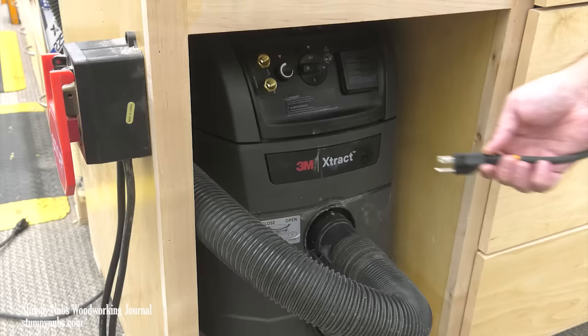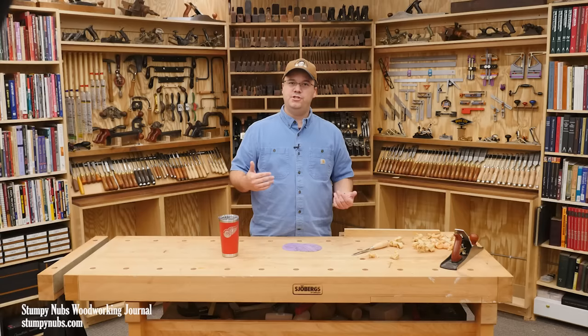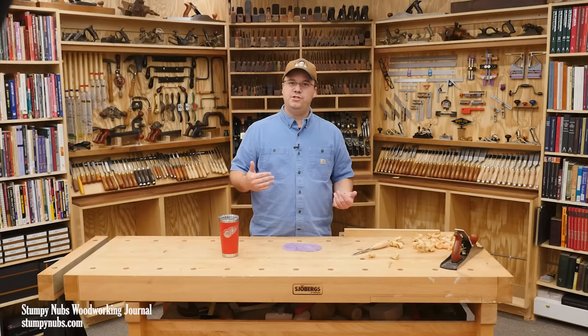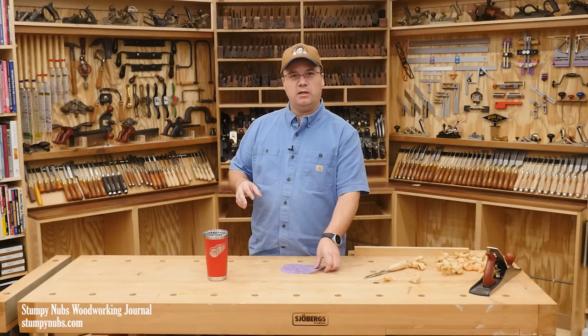I always knew that attaching a shop vacuum or a dust extractor to your orbital sander was a good idea. I always notice a huge difference in the number of dust boogers that I pick out while watching television in the evening. She appreciates that, and I appreciate how keeping that ultra-fine dust out of my lungs helps keep them nice and pink. I've also made videos in the past that discuss how dust collection will help prevent little bits of stray loose grit from getting stuck under the sanding disc and causing those awful pigtail scratches that can ruin your finish.